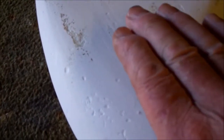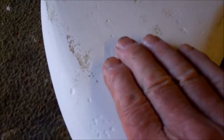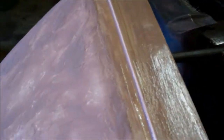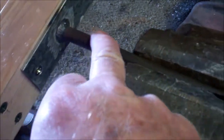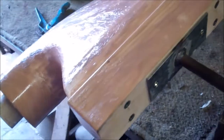I've covered the polyurethane with a thin coat of plastic filler. I'm going to put a plastic sealer on there now, and then I shall put a thin layer of silicone onto that before I put the fiberglass on. I've got that covered with a thin coat of silicone. I welded this steel rod here so I can turn the whole thing around as I'm working on it.